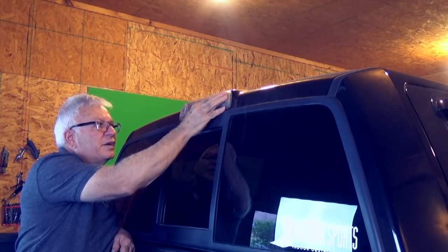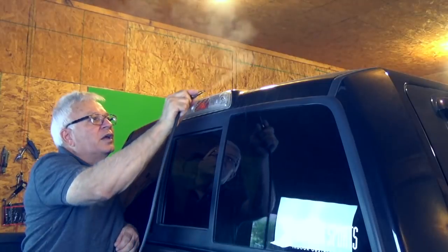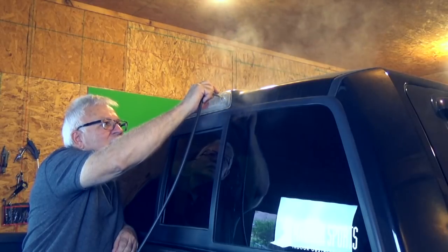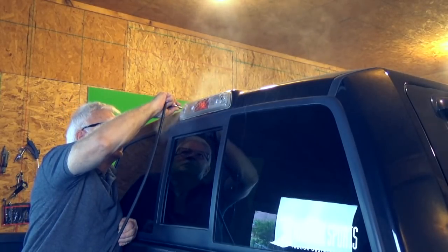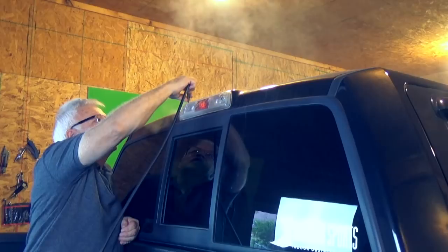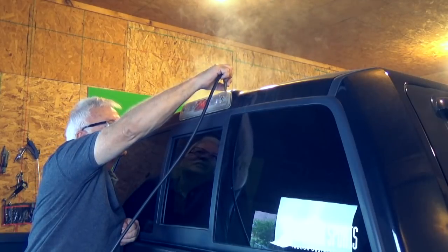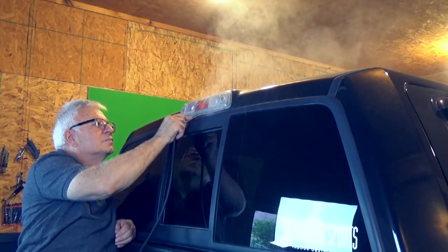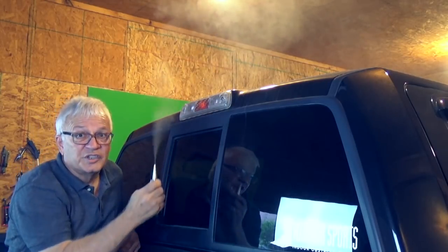So maybe we're leaking around here. We've got two screws — those screws obviously go right on in. So we're going to take our smoke now and put it around the screw holes, and we're going to put it around both sides. Someone on the inside is watching for smoke. I'm also going to take it around the outer lip of this thing and run our smoke across here. Let's see what's happening on the inside.